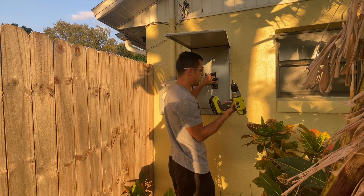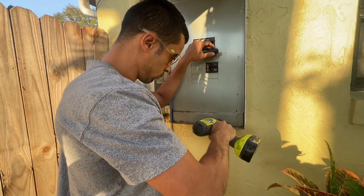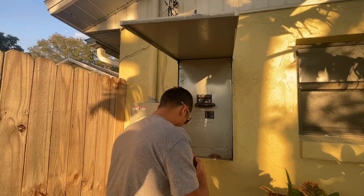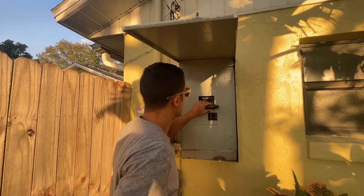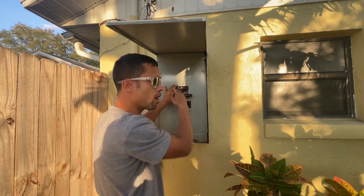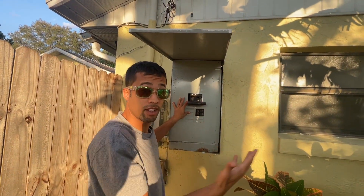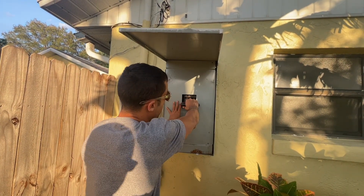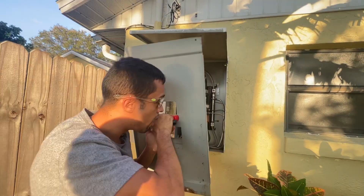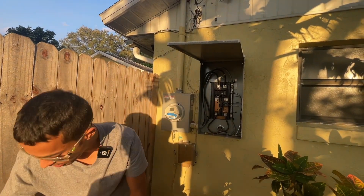I'm going to put the drill bit on the left-hand side and remove the screws. Once you have the screws out, this is why I like the magnet — you want to hold the panel cover right in the middle and use it as a shield for your face as you pull away. In the rare case it blows or there's a spark, the cover acts as a shield. Once I've established that I'm safe, I go ahead and drop it down, then safely access the panel.